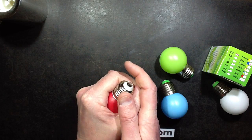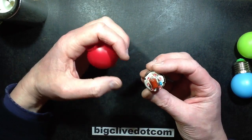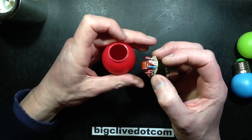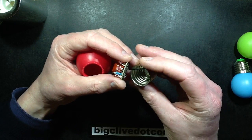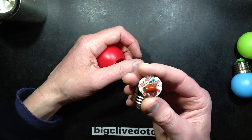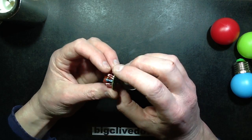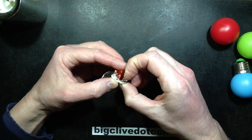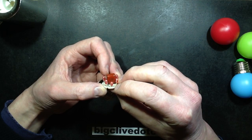Let's see if I can force this off using... the force. Oh! Yeah, that's good. So here we go — a little circuit board with 6 LEDs in it, probably wired in series. That resistor hooks onto the case, so that when the cover's put on it makes the connection to the outer ring of the Edison screw lamp holder, while the tip just does a wire up to the contact. I'm not seeing a bridge rectifier — that's a bit odd. Not even hiding under the capacitor. How odd.